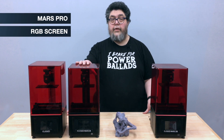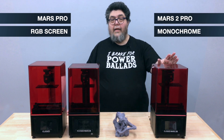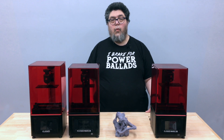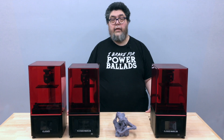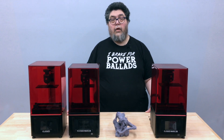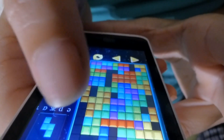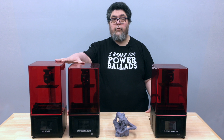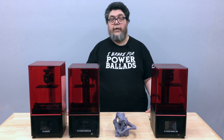The Mars Pro has an RGB screen which it uses to activate and solidify the resin. The Mars 2 Pro has a monochrome screen — this is actually a big deal. With this class of resin printers, the entire layer is cured at once. The screen underneath the resin vat lights up, UV light cures the layer, then the layer lifts up and the whole process repeats. Earlier resin printers like these used pretty much off-the-shelf RGB screens — basically smartphone screens whose wide availability made them affordable for consumer resin printers.